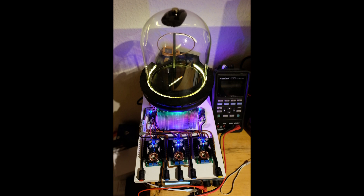A quick overview of my cloud chamber particle detector. The power supply is a 30 amp power supply sitting at the bottom, that only draws about 11-12 amps at the moment. I have three DC-DC converter modules to power each of the three Peltier modules, which sit underneath here on top of this CPU cooler.